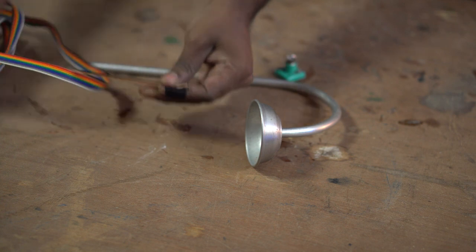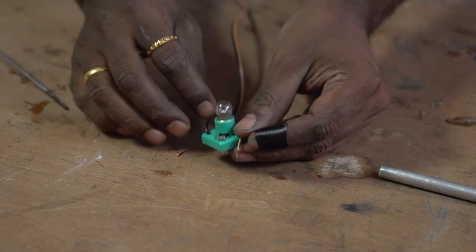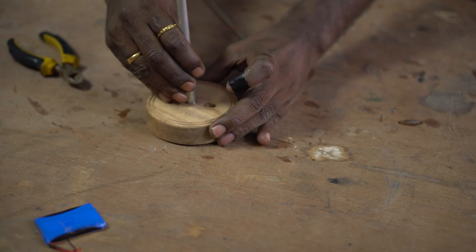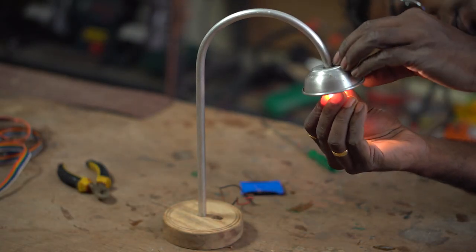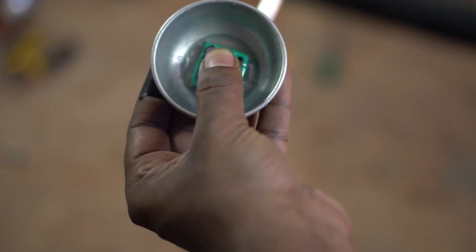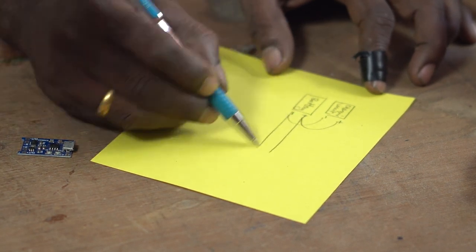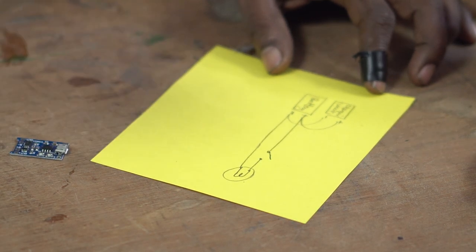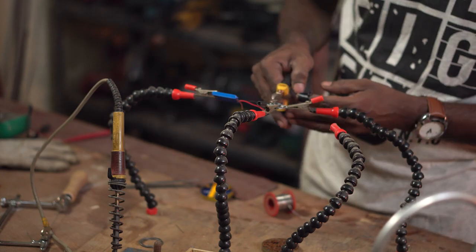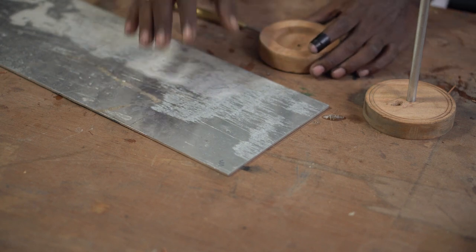These are some low resistance DC wires that I picked up from the electrical shop. The advantage of this bulb holder is it doesn't need soldering, making it an ideal choice for school projects. In this case it also doesn't take much time to thread the wire through the tube. Once the tube is inserted into the base, the lamp takes its form. The connections are quite simple: the battery is connected in parallel to the charging module, and two wires go to the bulb with a switch attached midway on one of the wires. These wires need to be soldered. After it was done, I did a quick check and it works fine.